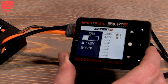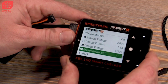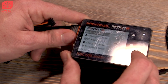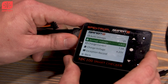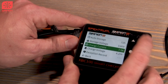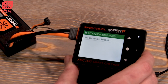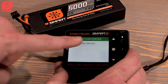This is a pre-production unit that I've been using a lot. If we press and hold, we go to the smart menu. This battery's auto storage has been turned off — you can turn that on right here. I like to set mine to about 72 hours, about three days. So if I leave it fully charged and forget to discharge it, it will start putting a load on the battery to discharge it down to a safe storage level. You can change the charge current, storage voltage, and charge voltage — it won't let you go above 4.2V. And there's an exception record: if there's an event that caused it to over-discharge, overheat, or overcharge, it will be displayed here.